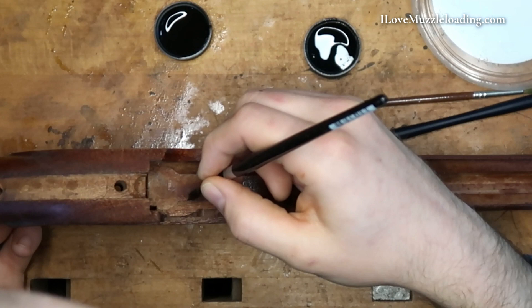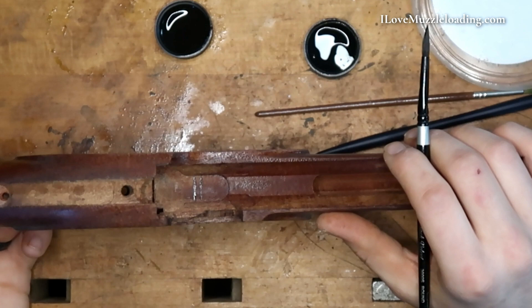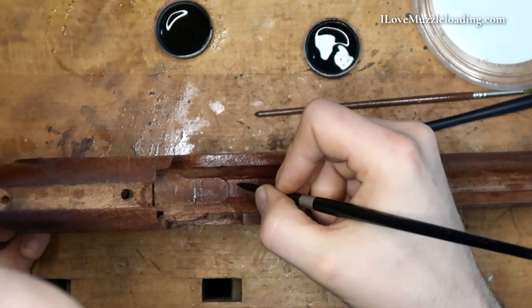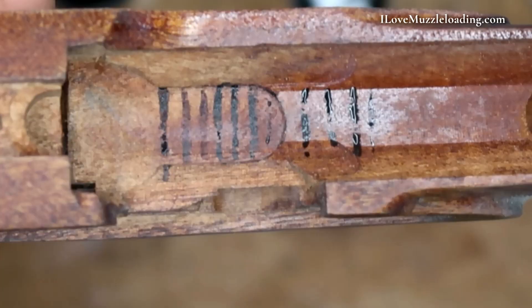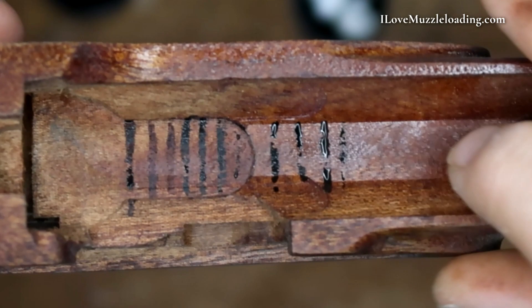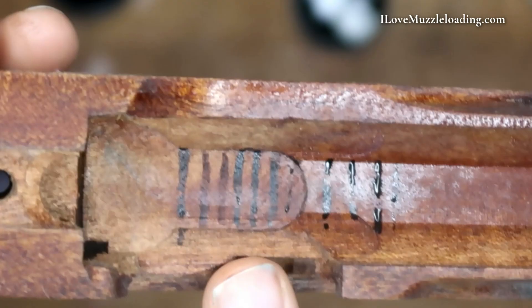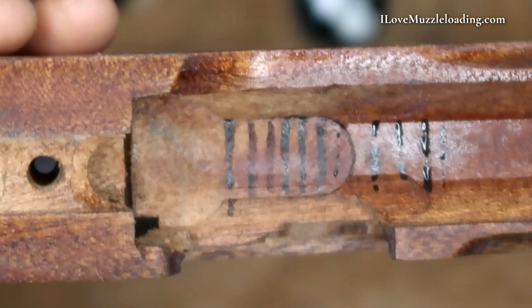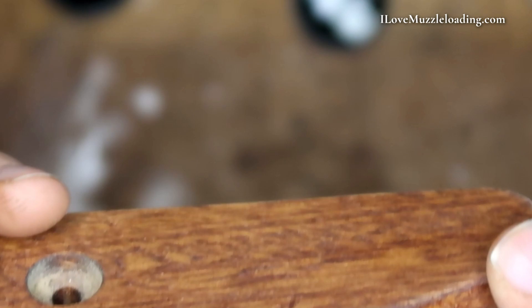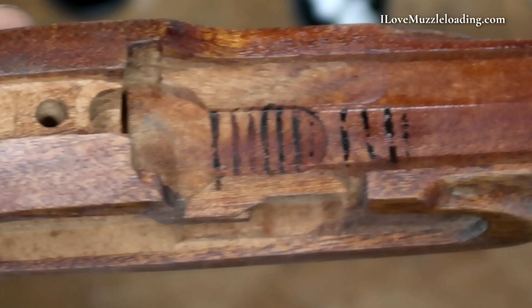That number six doesn't look too bad, really. The ink is setting on top of that oil a little bit, but I can see that it is going through with time. So I think we just need to be patient. You can see a few of the lines that I've put on and tested. This is a spot with quite a bit of oil in the wood and you can see the ink taking a little bit — it's kind of sitting on top there, which has me a little nervous. Back here we have a spot that didn't get a whole lot of oil and we can see there that the ink is soaking nicely into the wood and it's not bleeding as much as I thought it would. I was a little afraid of it bleeding, but now I'm a little nervous that I applied too much oil to the stock and we might have some issues with it setting. So I'm going to let this dry and then probably scrub the oiled exterior of the stock a bit more with our Scotch-Brite and get back to that wood a little so our ink has some more space to get in there.